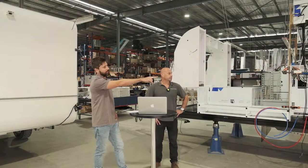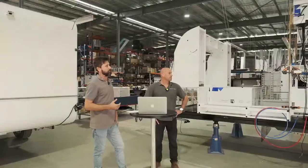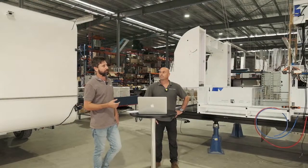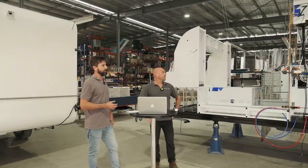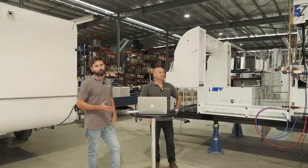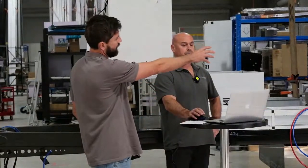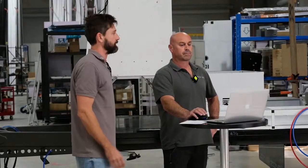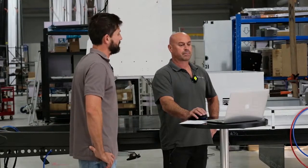If you look at that kitchen there, that kitchen is an extremely heavy structure. If you saw the other side of that kitchen, there's 16 opening drawers that come in and out of that. And obviously people who are going off-grid and are storing a lot of food and gear in that kitchen, a drawer is their number one preference. So you can see the amount of weight that is smack bang over the axles. And again, it's that weight over the axles that really does help with making these a well-balanced caravan to tow.